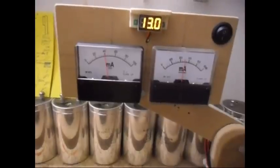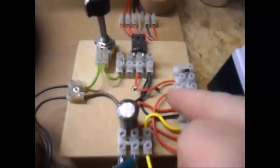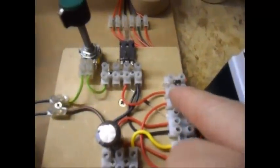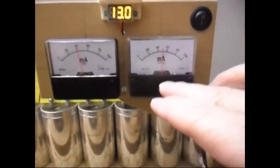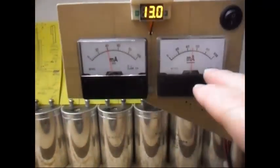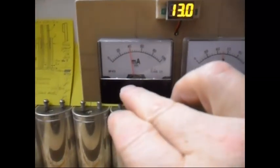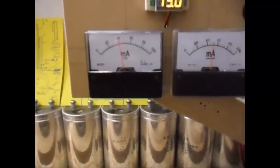Because this is just a basic setup — I haven't done any other system testing with other coils. And maybe instead of using one diode on the back EMF, I can use a bridge rectifier or something like that and get some better results. So once more: 50 mA going in total, 40 mA going back through the back door — back EMF — back to the system. So this system is now running on 10 mA.